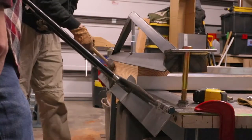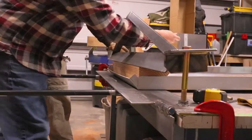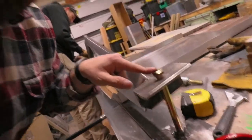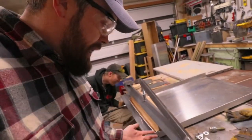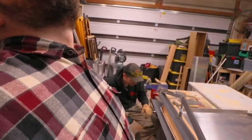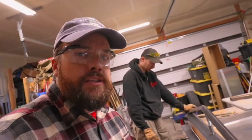Hold on — the entire piece of metal shifted all the way back. That's okay. The stock walked — it got moved backwards, so we've got to put a spacer in our bolt and make sure it's really clamped. The wood really likes to walk on us — this is the second time. We might need another washer. We may have broken our tool. We had to add that big board because it was bending the table and not making our plane flush.